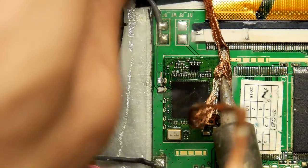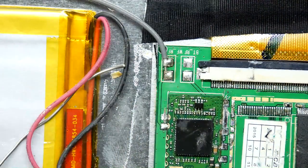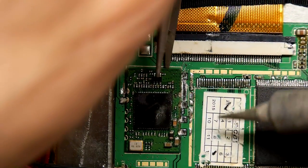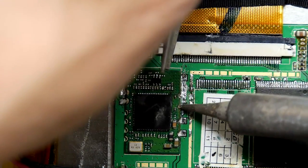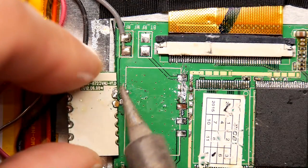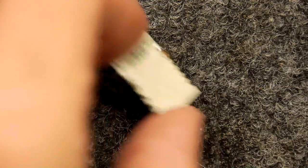It's sucking the heat out of this board already — this is one painful PCB to work with. There, not much solder left on that one. Let's see if we can lever this chip up. Come on. There we go — it's being unbelievably tenacious. Let's get this out of the way. And we could actually use this to clean up our PCB. So it's slightly bent — that's not going to be a problem, I've unbent it already.